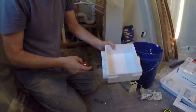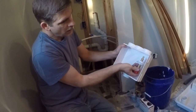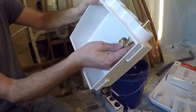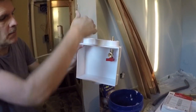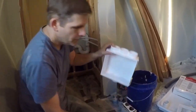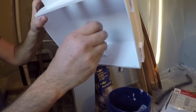There are two ways of doing this. You can have your drain here and your valve on either side if your plumbing is coming from underneath. But we're flipping this box so our supply valves are going to come from the top — they have these indents so you can lock them in. We want our drain to be at the bottom, and it has this little plug here that we've got to take out. To remove this plug, we use a fine screwdriver and hit it on that seam all the way around until we can knock the plug out.